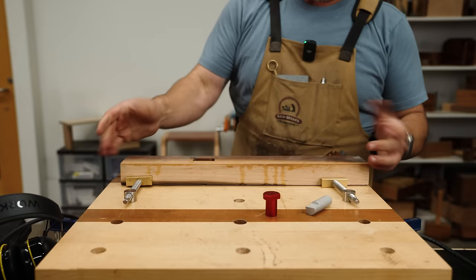And those are the three ways to be really safe with your router. If you use those, you're going to be fine — especially the small bites. You shouldn't get kicked back if you are taking small bites. Let's talk about the different types of router bits. Here are the three basic types of bits — this is not to say these are all the types of router bits, there are tons of specialty bits out there, but this is what you are going to use 99% of the time until you get into more obscure specialty parts of furniture making.